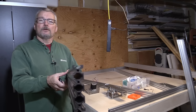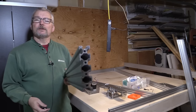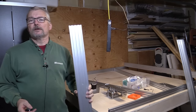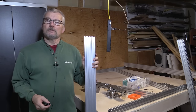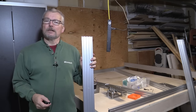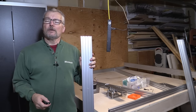I know a lot of you probably already know how to do tapping, but for those of you that don't, I'll give you my two cents worth. I've seen lots of people do it using a drill — my only concern there is you have a high risk of either cross-threading or snapping the tap into your work piece, and then it'll be quite difficult to get out. I prefer to do it by hand — that's the way I was taught many years ago, and the taps I have are more geared towards using by hand anyway.